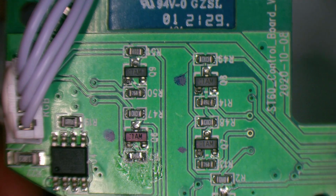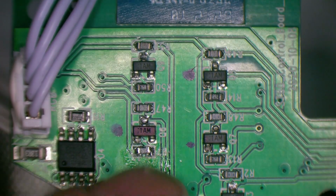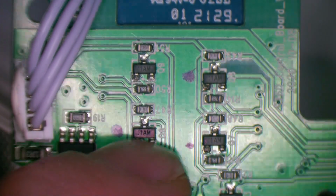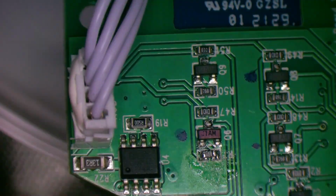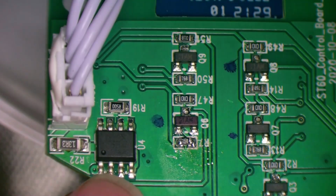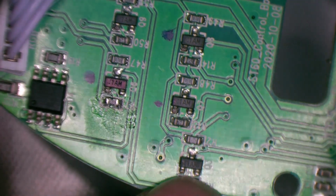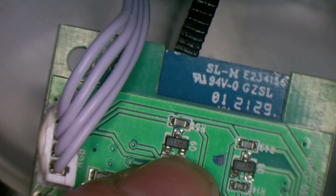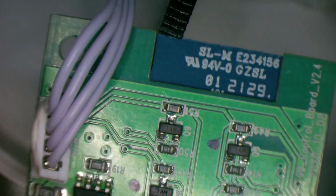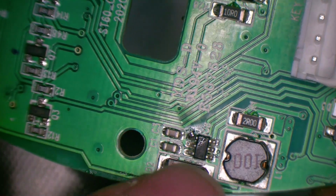I found out that module controls the three transistors. I put a blue dot next to there. They are our RGB projector diodes. So these are controlling the brightness of each one in order to enable them, disable them, etc. Bring them up and down. Through this IC, pin 2 is a PWM dimming pin. So that's what they do. This transistor turns on the motor and has speed control. So that's PWM controlled as well. This one goes to our laser diode module. That goes to the enable pin of the laser module, which can be PWM again for laser brightness.